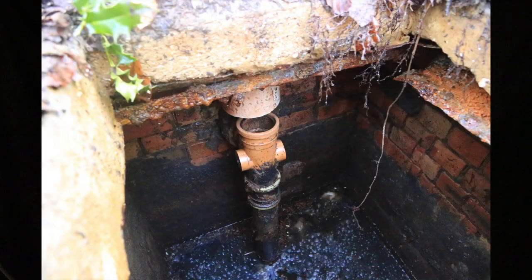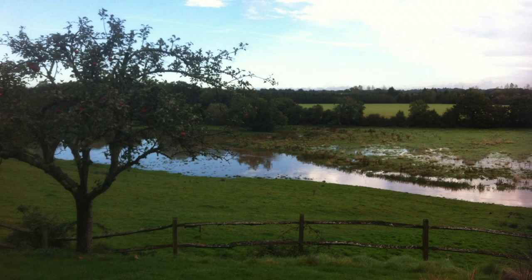You might have an old septic tank, but I don't mean a cesspool — a cesspool is just one chamber, it has a discharge, and if the ground is wet, it is not a septic tank system. If it's just one chamber, or it's discharging into wet ground, or it's got two chambers discharging into wet ground, it is not a septic tank.